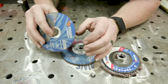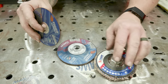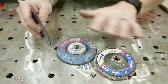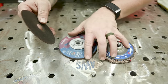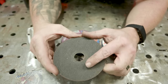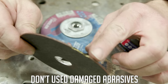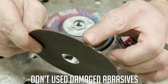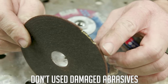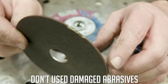Go through the cutoff wheel and make sure there are no nicks, dings, scratches, or grooves. Here's a prime example: this one was probably left on a grinder that fell off the table and chipped the side of the wheel — this whole disc is now compromised. That doesn't mean stick it in the grinder and use it until that part wears out. Here's what could happen...